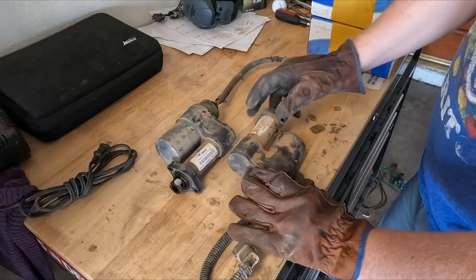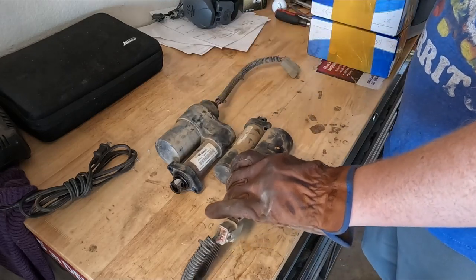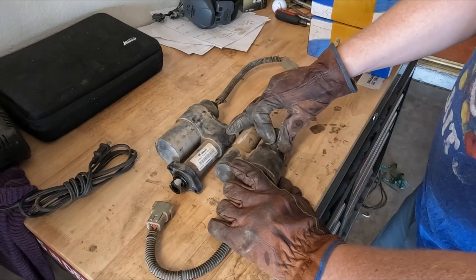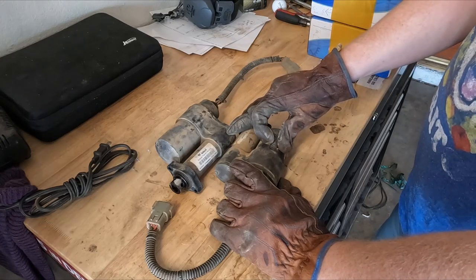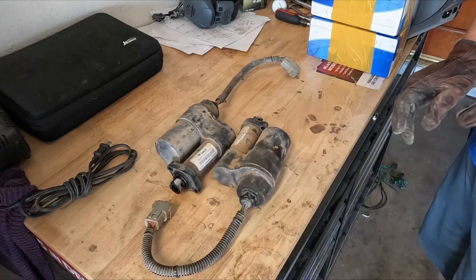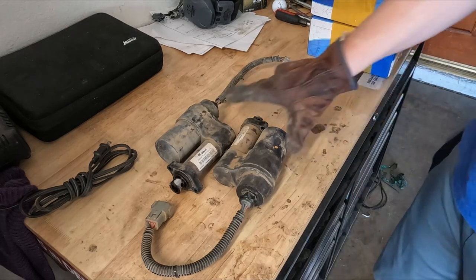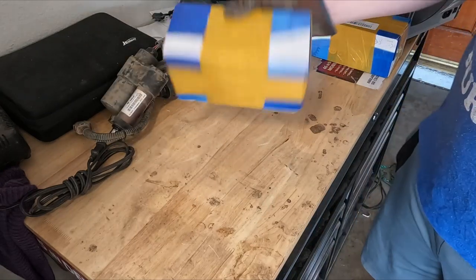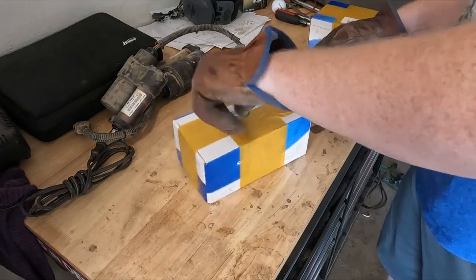So, for the Bobcat, the lower one, I believe, is for the bucket, just to control the tilt, and the upper one is for the arms to lift it up or down. So one of these was bad because the lift tilt control light on the Bobcat kept turning off, and that made the hydraulics stop working. We believe these are broken, or they're busted, or something, they're old. Bobcat's like 2008 or something like that, so it's an old machine for sure. We're gonna see if the new one works or not.